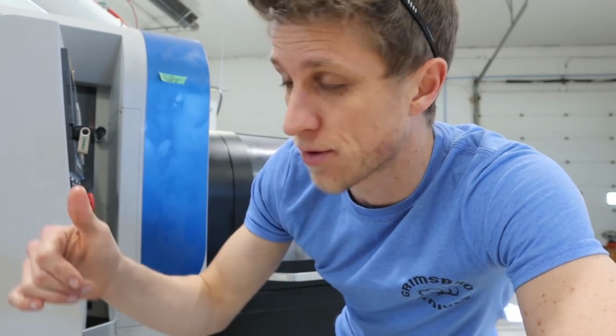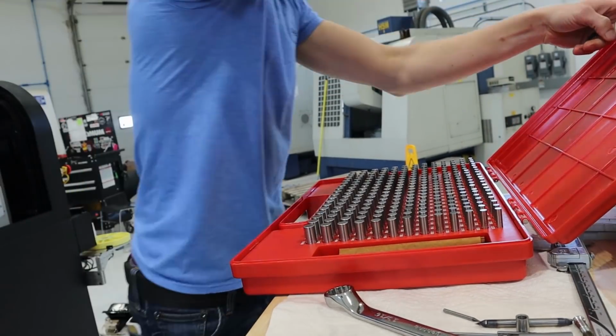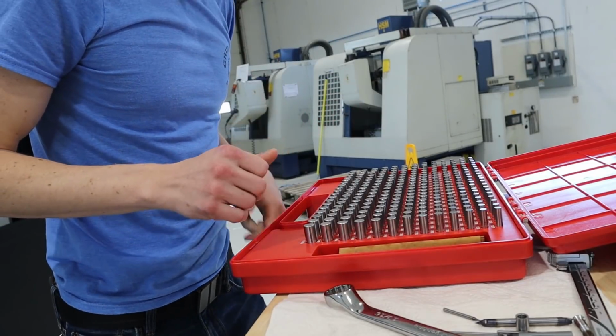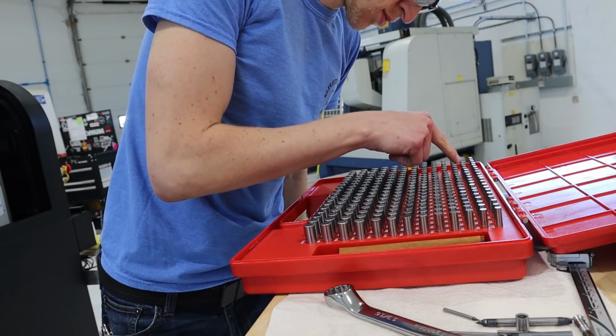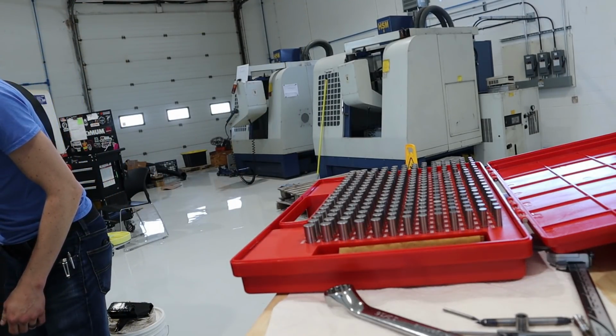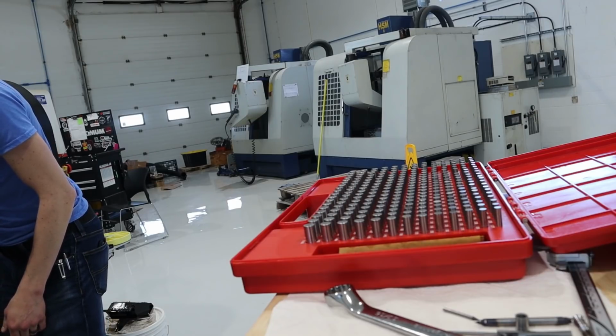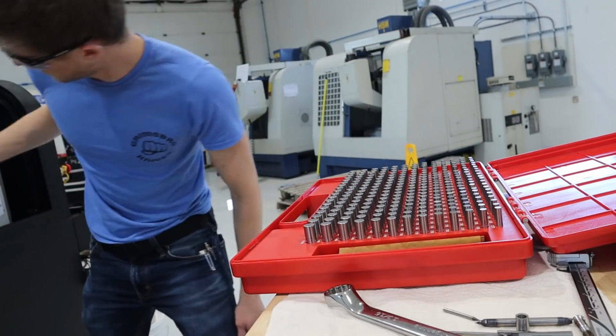So I'm going to .305. I paused it right now at a pass that did .297. I'm gonna go get a gauge pin. I'm gonna test fit because I just set up that tool. I don't know how close it is. I don't want to shoot for .305 and end up with like .315. That would be bad. So while it's still undersized, I'm gonna test fit. Super duper close. .297 was too tight, but I bet you a .296 will fit.